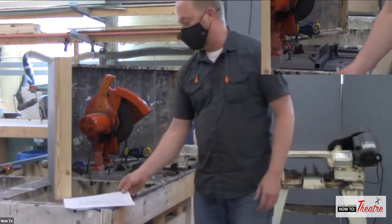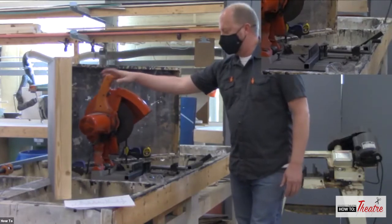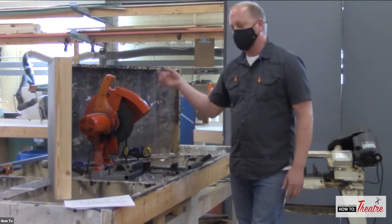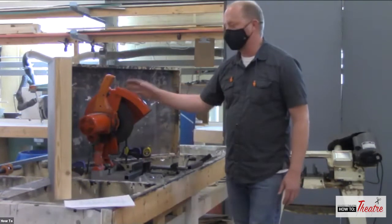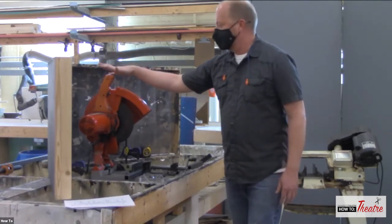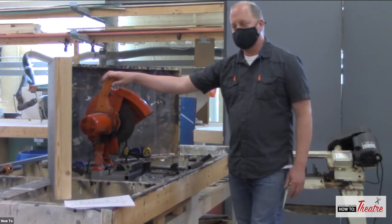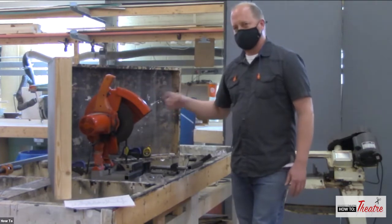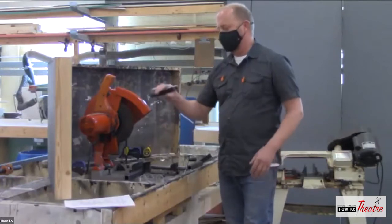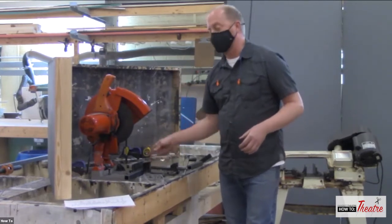There's other saws, which we do not have, but there is a cold cut saw, which is similar, except instead of an abrasive blade, it's just a carbide tipped blade, which is not expendable. It just is really sharp. And I can't just put one of those blades in here because it spins at a specific speed, which does not correspond to how fast this one spins. So maybe someday I can get one. But the biggest problem with that is it's even louder than this one. It's really loud because, again, you're taking chunks out of steel with a spinning blade. So it's really, really loud. But you don't get that little burr on there because it's a clean cut. So you save a lot of time by not having to clean all that stuff up.